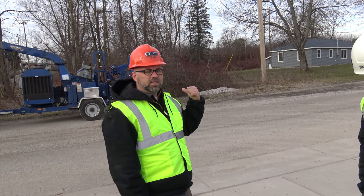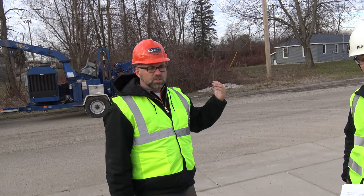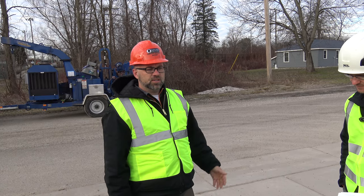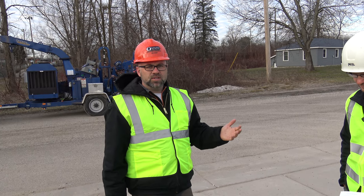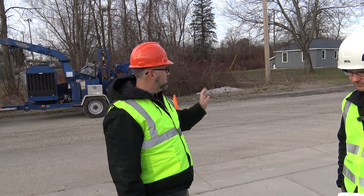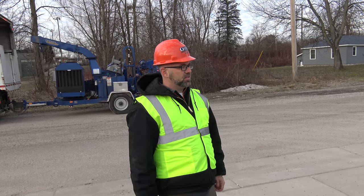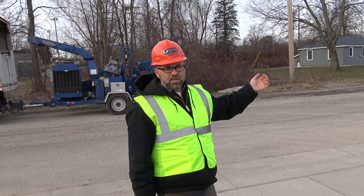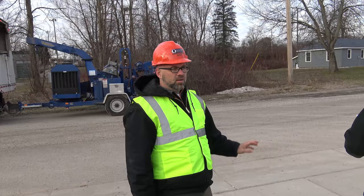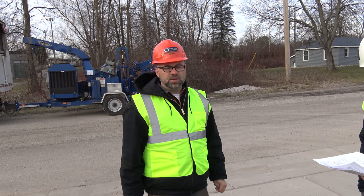The only thing we missed here today is pedestrian safety. You're going to have signage on both sides of the road for your road signs. But you're going to have pedestrians coming by, passersby that are interested in seeing what you're doing, and we want to keep them back also. I would say cone safety on a sidewalk, we'll get into that too, but there's probably a specified space. Maybe it's common sense, but it's going to be the neighbor's property, or maybe a couple hundred feet back on a sidewalk on each side would be safe.